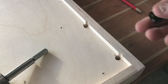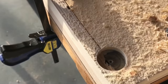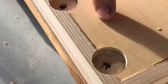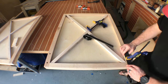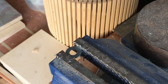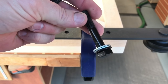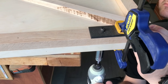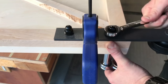Now I've got a little problem — there's a bit of a gap I need to address with a Forstner bit. I go ahead and put a quarter-inch piece of plywood flush trimmed up to it, which helps the drill bit drill into the material. Once that's removed, the nut fits right in place. As I start to mount these rollers to the door, I realize the carriage bolts are too long. So instead of trimming them off, I've taken some washers and made the holes in them a little bit bigger in diameter, so the washers act as spacers underneath, giving the carriage bolt a little less room so these cap nuts go on properly.